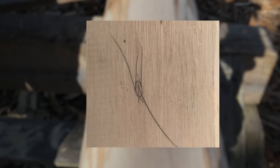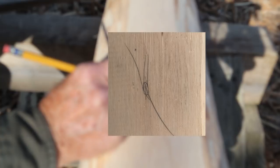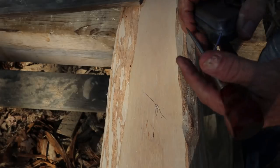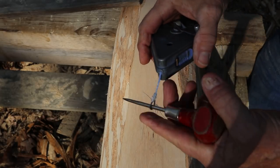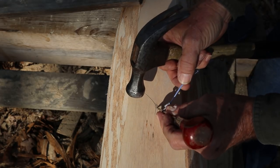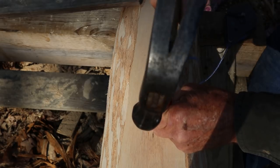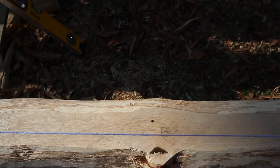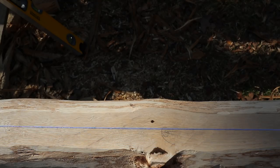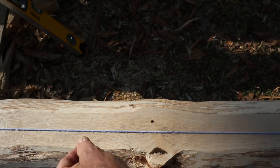I'll do that on either end and snap a line, and the line will actually cross that point. I'll go to the other end and get a center mark. I'm going to take an awl — I've got a loop in the end of my chalk line — and set that right on the point, very gently tap it in there. Then I'll go to the other end, knock a little bit of the blue dust off the line, snap it just a little bit, pull it real tight, and center right over that mark.